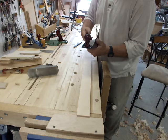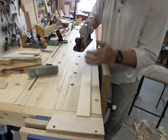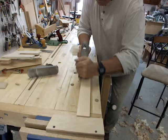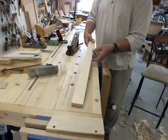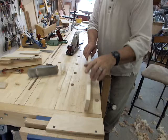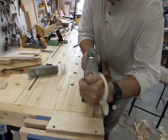Turning the knob out pulls the iron up; turning it clockwise pushes it down — it's actually reverse thread, so it moves the opposite way of what you'd think. I'm done to here; I can start right in, square up, lift, move over, overlap the cuts, lift, and done. Don't assume that because the grain runs one way it automatically works going that direction — it may need to flip. In this case it does; you can see the lines going this way so I had to flip it. Now I should get a perfect cut with the grain and perfect width.